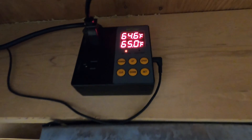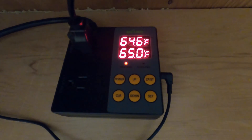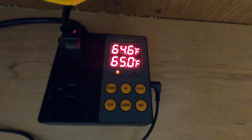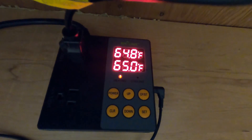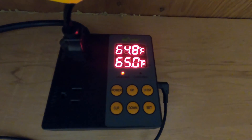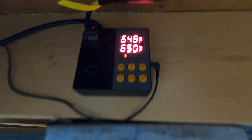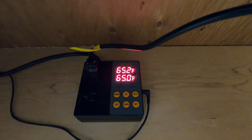The AC blower shut off in the furnace. I changed the set point to 65 — so as soon as the duct reaches 65 degrees the vent booster will shut off. That will continue to warm up; it'll be interesting to see what temperature it goes to.